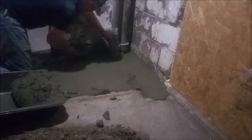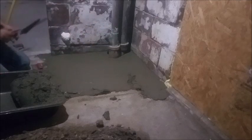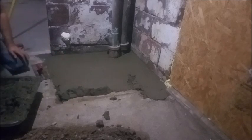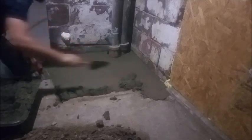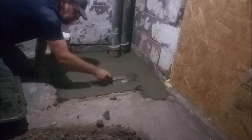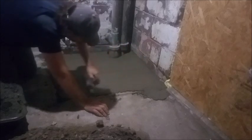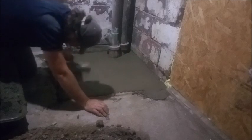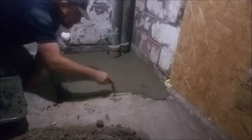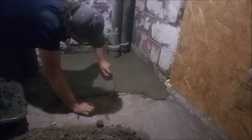What I did underneath where the drain was: I took the time to plug the drain with a plug, because that still goes to our vent line and the bathroom above on the first floor. We don't want to block any of that so water and air can get to where it needs to go. I just put a plug on it and it's still beneath the cement. It doesn't have to be accessed because I have a clean-out right there that the lines can be cleaned in case there's any blockage — you can use your imagination on that. The hole itself is plugged.